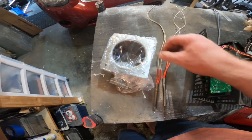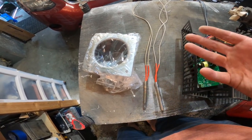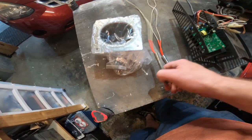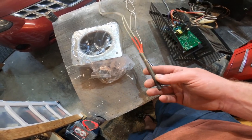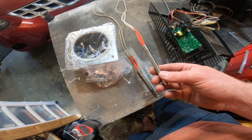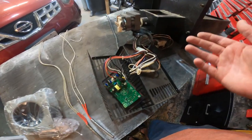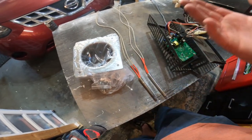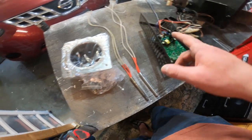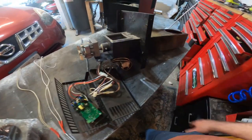It's been a couple of days. I got the new fire pot and the new hot rod. Together these were about $25 on Amazon — I'll link to it in the description, really cheap. The ohms on the old hot rod were about 78 and the new one I ohmed out already is about 72, so they're actually not that far off. I can't find anything else wrong, so I'm going to go ahead and do the hot rod anyway — I mean, what's $25? I'm going to feed it back up in there, put the hot box back in, reassemble everything, and see what happens.